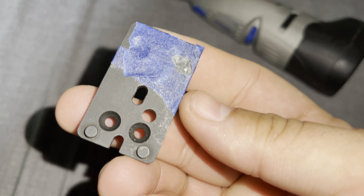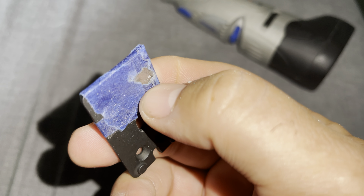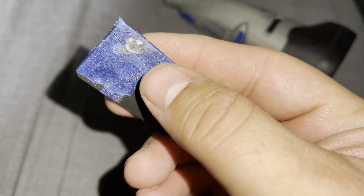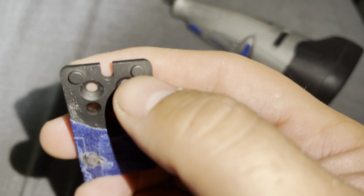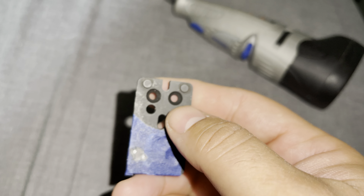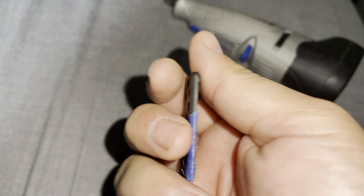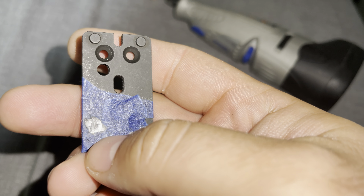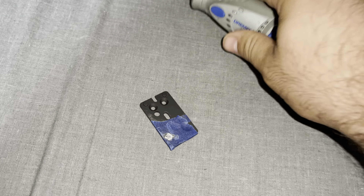This is how the plate looks — I need to trim this one all the way, and then trim this too, just a little bit, in order for the Holosun to fit on this plate. This is the number two plate from Springfield; you'll see the number right here. We'll be back shortly, but I'm using a Dremel with the stone wheel.